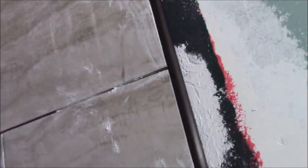Here's the problem with attaching it to the wall first: you have the flat surface of the wall and the flat edge of the trim edging, but by the time you have your thinset, your back-butter, your tile, and thinset troweled on the wall, you're not going to have a flat edge. If you do, you're either very lucky or probably doing it wrong.